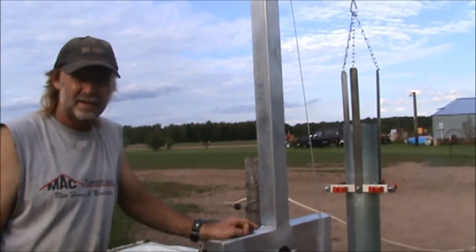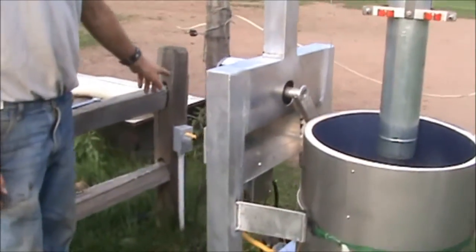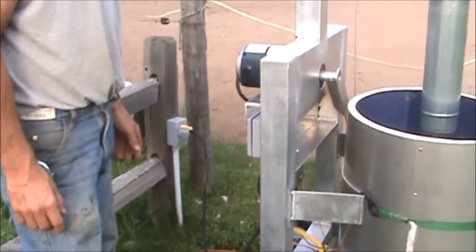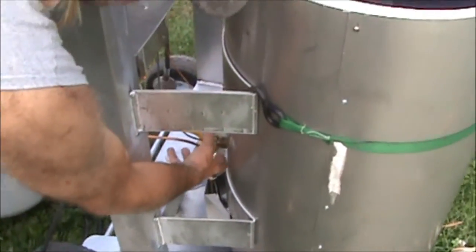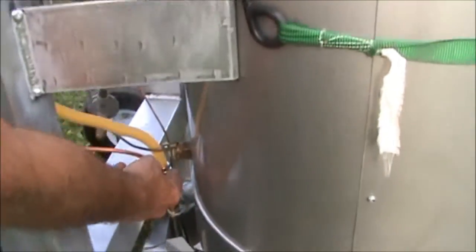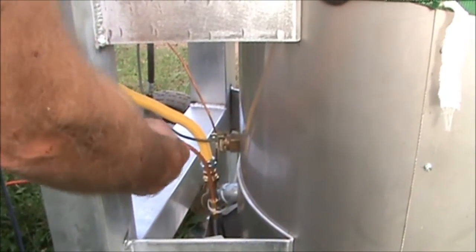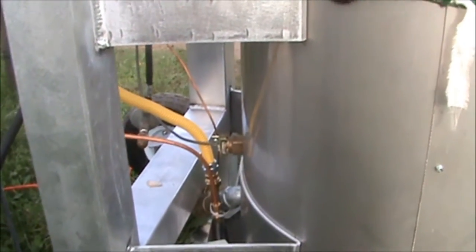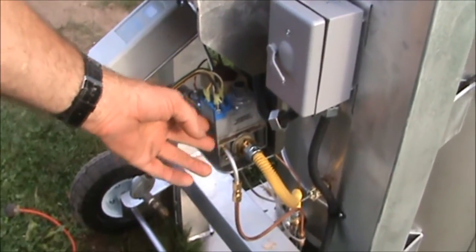It runs on a 110 outlet, and our plucker also works on the 110 outlet. This part is from an old hot water heater — usually the brain box and temperature probe go right here. We had to extend our lines and use a different probe because it goes into an electronic brain box which is over here, and the temperature probe goes into here.